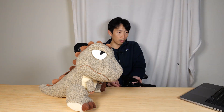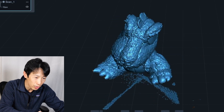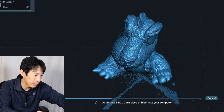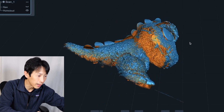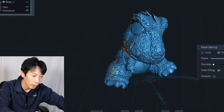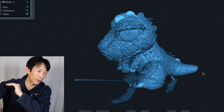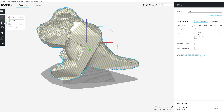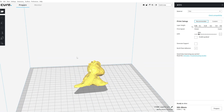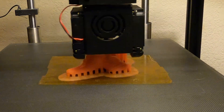This works best for things that are bigger than six inch cubed. Let me scan the channel mascot here, T-Rex. The bottom of the feet is hard to scan and then the bottom of the tail is hard to scan. But let's just finish up this model without too much special touch-up or anything. The optimizing part takes a few minutes — it looks like a big ball of oatmeal and it didn't get one side of it too much. But let's just ignore that and start meshing it. The texture of this makes it seem very rough, but it's really like a fur. It uses a normal color camera to map the colors onto this 3D model. Now it looks like the real thing. I import it into a software called Cura — this prepares a STL file for where to print it on the printer, what kind of filament it's going to use, and tailors a special file that works with your 3D printer. This print took roughly six hours.